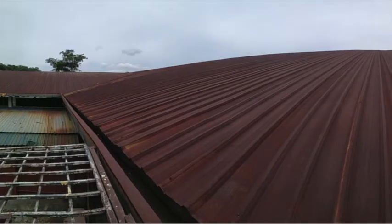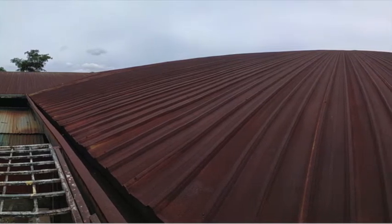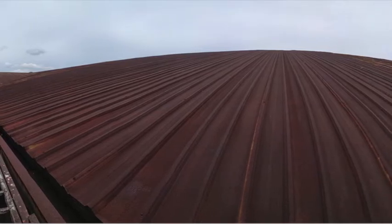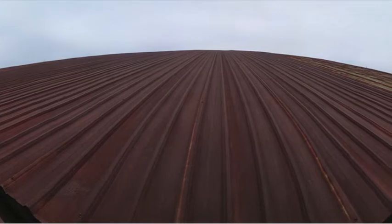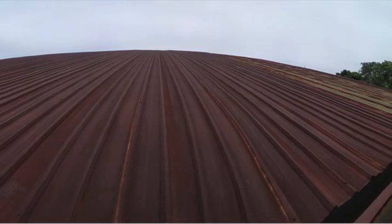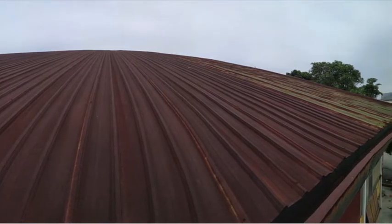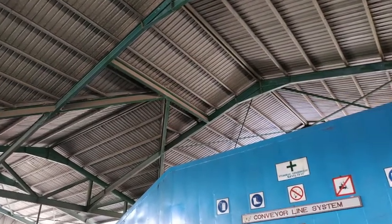The metal roof surface is totally rusted. This rust is not only the immediate stage right before corrosion, but it also increases dramatically the heat absorption due to the surface getting darker and less reflective, and due to the increase of surface area as a result of roughness increase. However, the metal roof is still intact structurally.